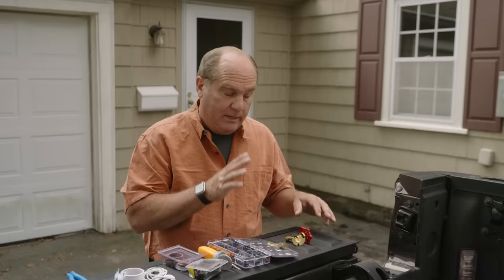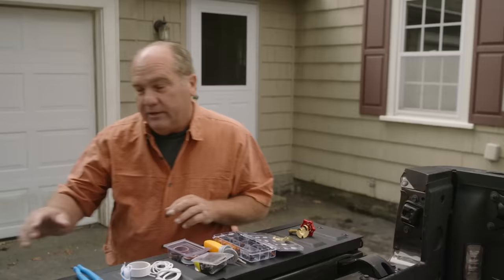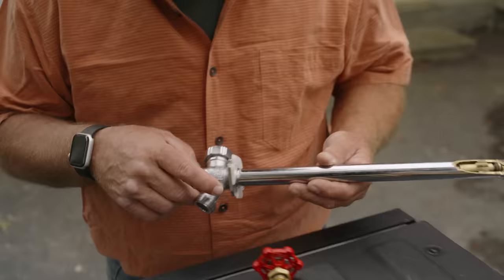This is what you see most often on most houses in America — it's cheap, it's sort of the standard. But every year, if you live in a cold climate, you have to think about how to make sure you turn off the inside faucet and drain this out, because the water's sitting right here in harm's way where it could freeze.